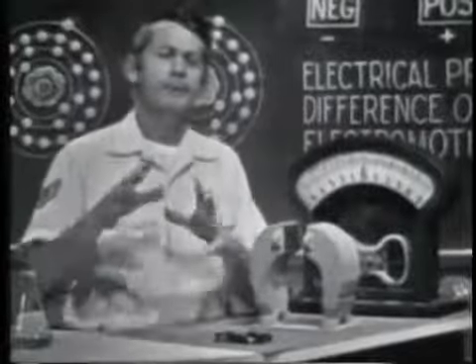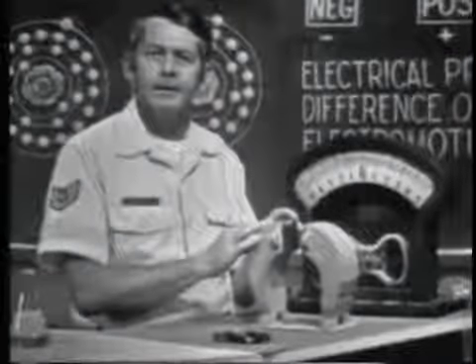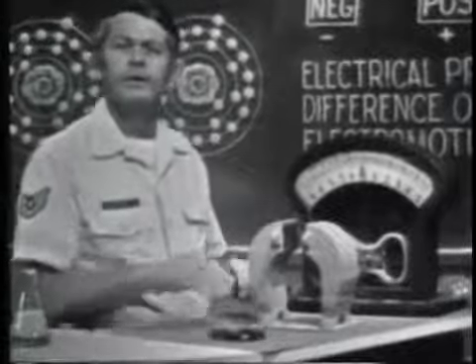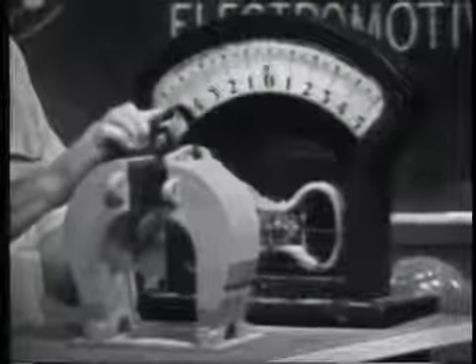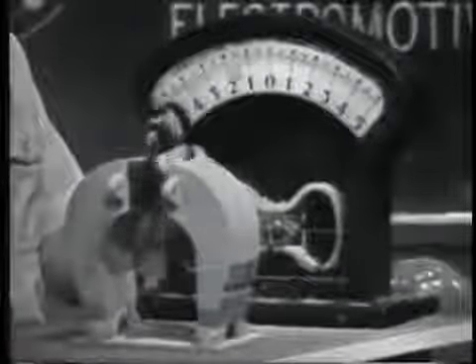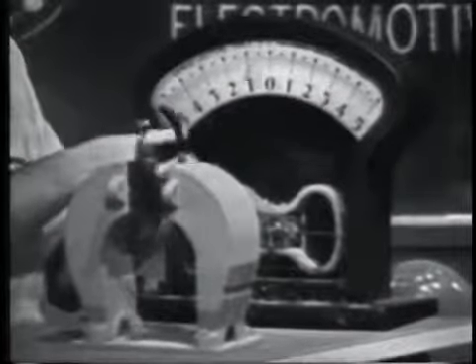Let's demonstrate this method. We need a magnetic field, a conductor, and motion between the two. Here's a magnet — it'll give us the magnetic field. This coil of insulated wire is a conductor. To check for a voltage, I'll connect the conductor across the meter. When I start moving the conductor, notice that the meter indicates a voltage. It doesn't make any difference how the motion is attained — the magnetic field or the conductor could be moved. The important thing is there must be relative motion between the two. Notice that the meter needle swings back and forth as the conductor is moved, because the field forces electrons to one end and then to the other. The result is an alternating or AC voltage.